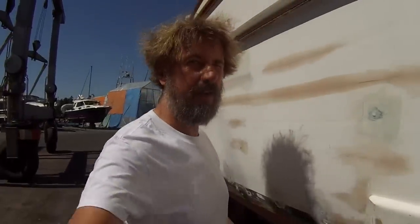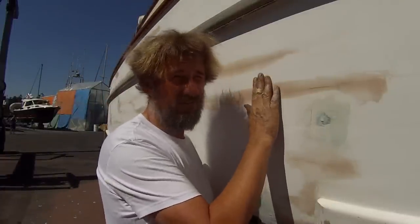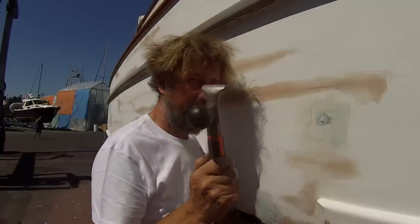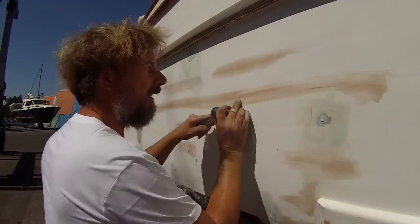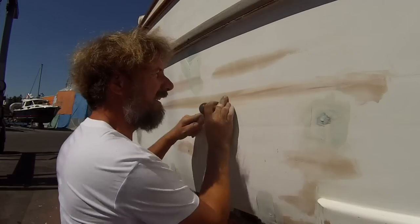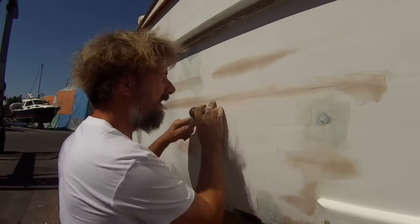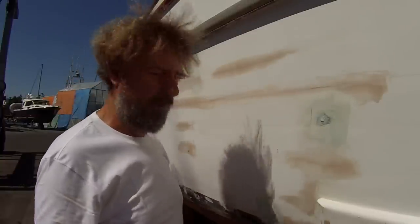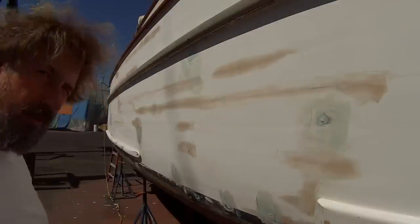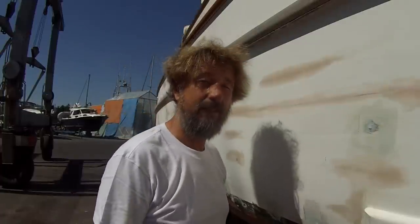Here's another really awesome tip — perhaps everyone knows this. When filler gets to just the right hardness, before or just as it's hard enough to sand, don't sand it — scrape it off. You need a good carbide scraper so it just comes off in a long, easy, clean stroke. Smooth, smooth, smooth. A quick final go with some fine sandpaper, and instead of sanding dust getting everywhere, you get nice little shavings that are easy to clean up. Fast, easy, clean. Love it.